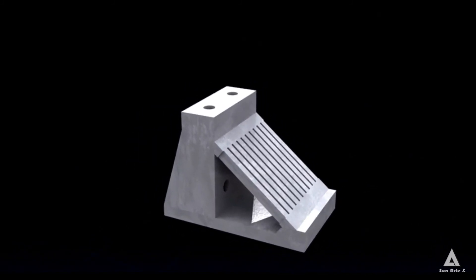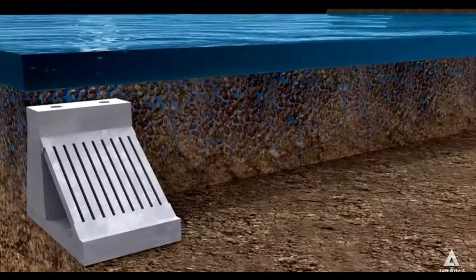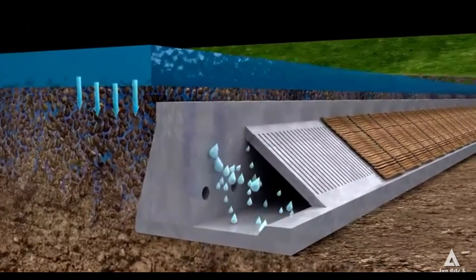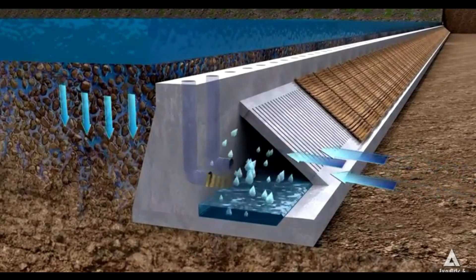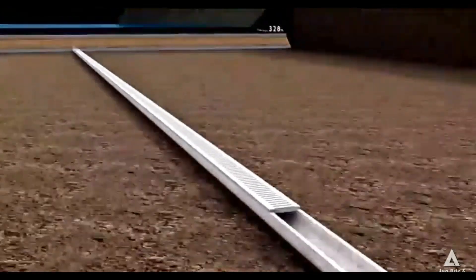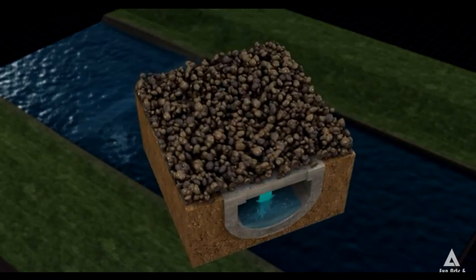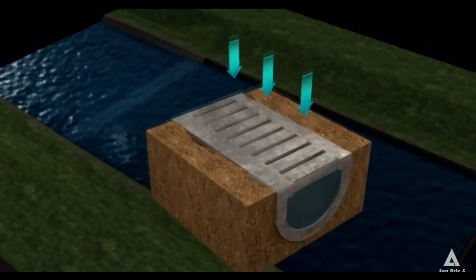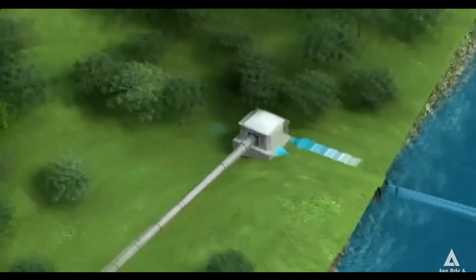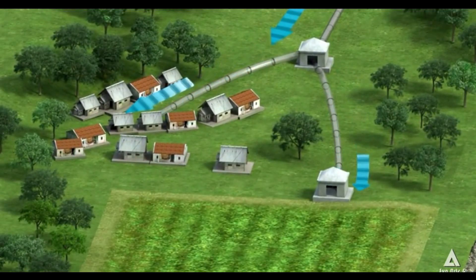Here is one of the dams installed below the river bed. The slope is 2.8 meters wide and 1.3 meters in another dimension, with small gaps where cement structures are placed along the length. Water is inserted into these small gaps and seeps inside the surface of these dikes. A 1.9-meter-wide semi-circular pipe with a filter bed is used — water filters through the bed and is collected in the semi-circular pipe. This collected water is then transferred for public use for drinking, agricultural purposes, or daily use.